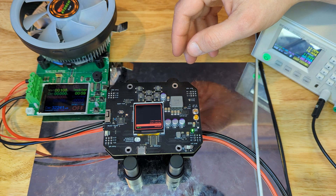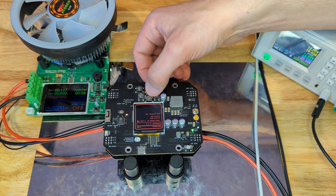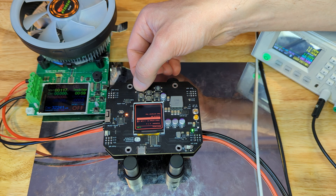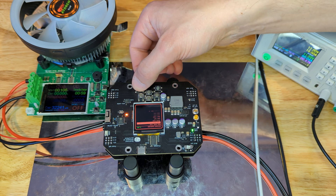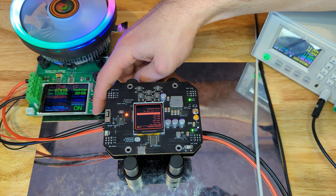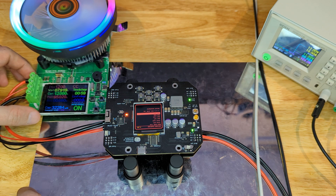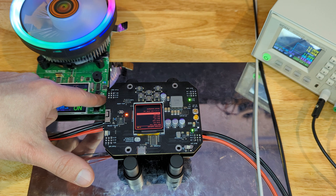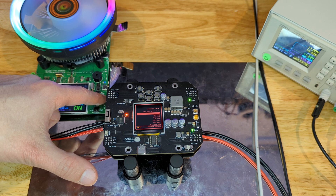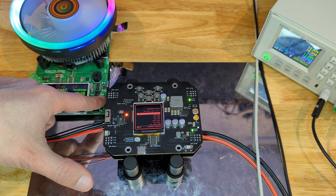What a rollercoaster of emotions. I got into work and saying I'm relieved would be a little bit of an understatement. Here's what I learned: the buck converter has overcurrent protection. When it registers too much current being drawn, it shuts down, waits for a couple of milliseconds, and starts up again until no more overcurrent is registered. The issue is that the overcurrent situation happens because the motors need that power to move into a position. When the buck converter starts converting again, the motor still wants to go to that position and immediately draws too much power again, which makes the converter shut down again. This cycle of drawing too much power, shutting down, booting back up, and drawing too much power again repeats every 20 milliseconds, and we get this seizing-up behavior of the robot.